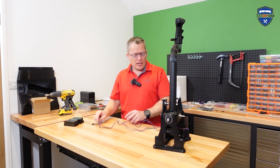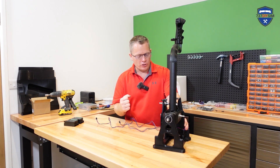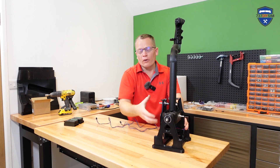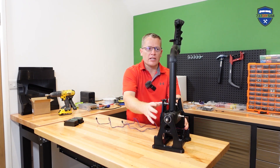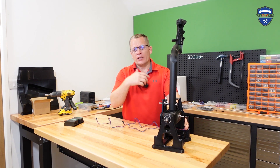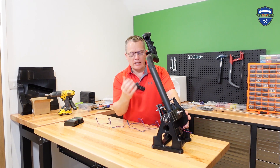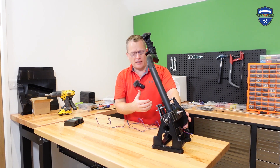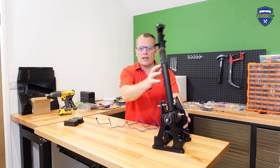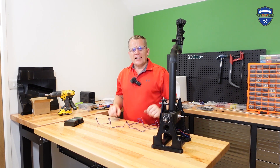We've got this bolt here that's going to go right through the center and support the whole assembly — it's a little too long right now but we can sort that in a later version. Because I don't have the correct size nuts I'm just going to use two bearings for the time being. Next up is to wire the stepper motors. We're going to use them initially as mag brakes like in the real aircraft — they'll hold the controls in a fixed position like the parallel actuators. When they're fixed, the controls move about the force feel units, which we call force gradient units in the real aircraft, and that's what these spring and tong assemblies are.